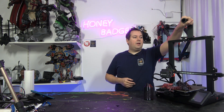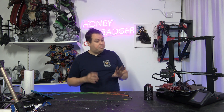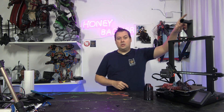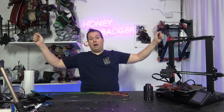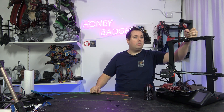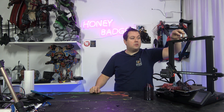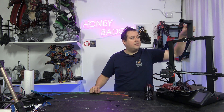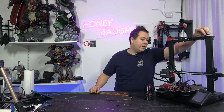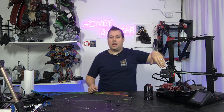There is a filament spool holder up the top. We don't use these filament spool holders — we have a rack of filament that sits above our printers. I don't agree with putting that extra weight up on top of these machines. You do have to have the spool mount up the top because that is where the filament sensor is, and the filament sensor actually goes down through the frame, so you couldn't relocate this — the filament has to come in from the top.